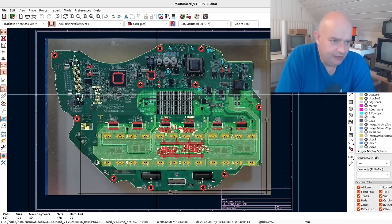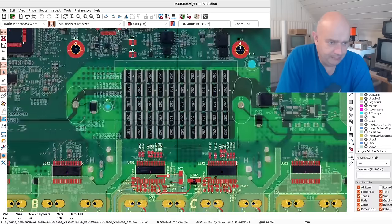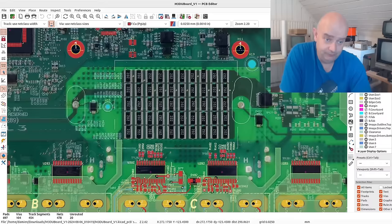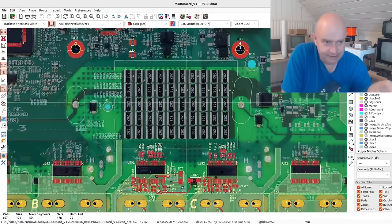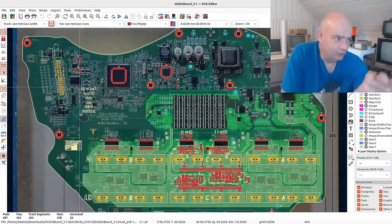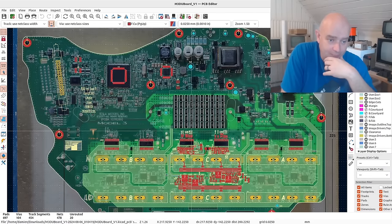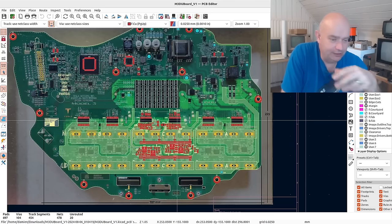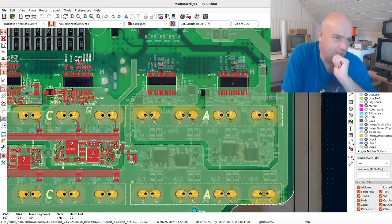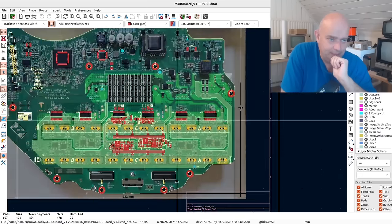There are things like, if we look in the middle of the PCB, you've got all of these resistors used to discharge the high voltage bus via this MOSFET here. So these components will be on the same layer as parts used for a more micro power setup over here. Having someone working on this stuff and being able to see how the layers work, the spacings, clearance distances — all of this is super critical.